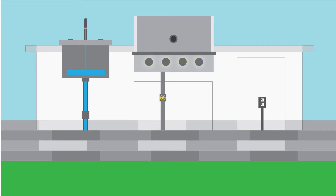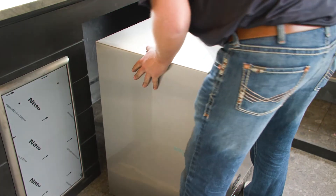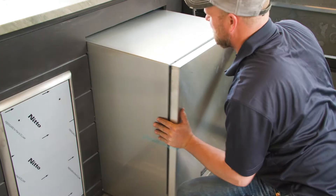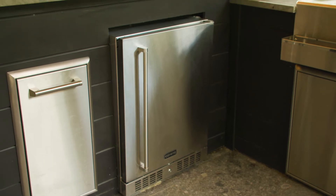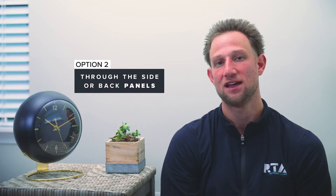Some appliances will interfere with utility lines that are stubbed up through your patio, so you want to be careful about where they are actually placed. For example, if an electrical line is stubbed up in the middle of where your refrigerator will go, it'll be very problematic — the utility lines will interfere with the refrigerator and not allow it to sit in its place. This will cause you to move the location of either the utility line or the refrigerator. Pre-planning your layout in coordination with the patio construction is critically important.